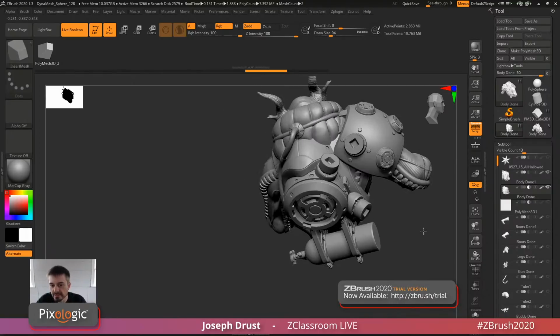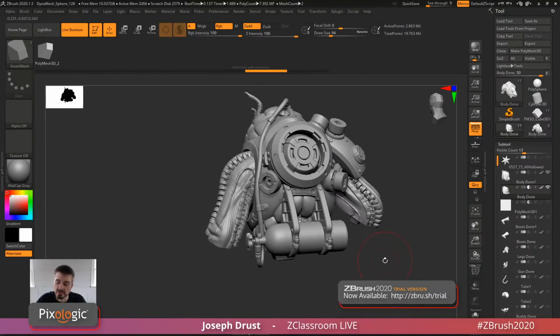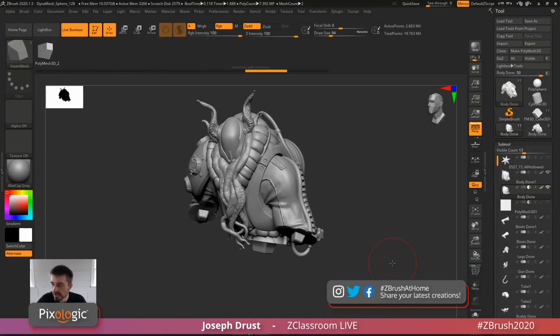The main thing is that the hardest part to find in terms of where to put holes is the suction, because there's no way to really calculate where that suction is going to be. So until you export this model out and see it in the slicer in Preform, it's going to tell you, hey, this is going to give you a suction problem. And then after you have that, I go back in here and I'll fix that problem.